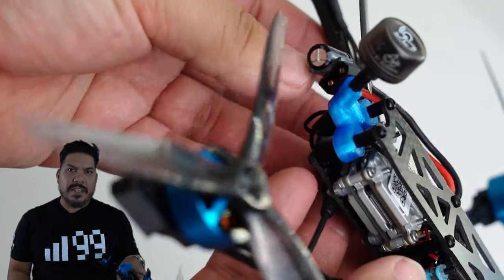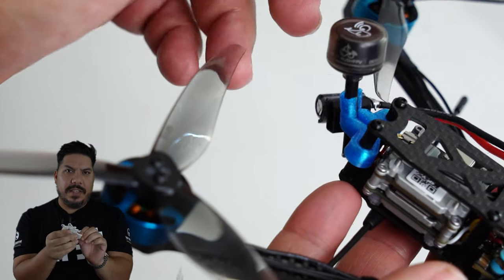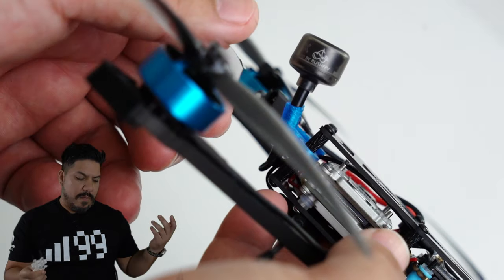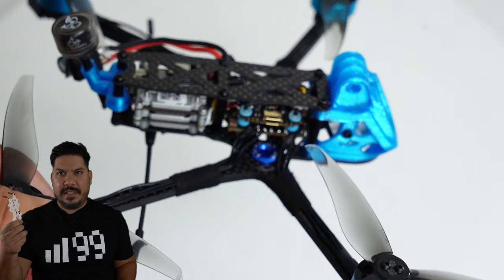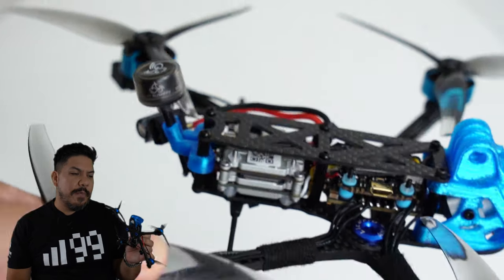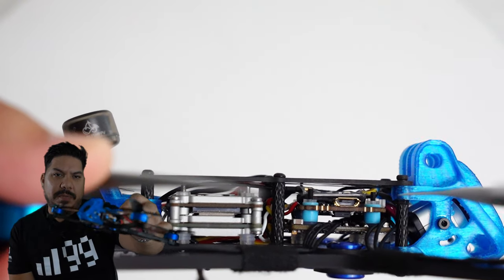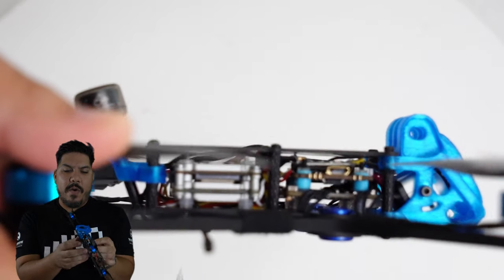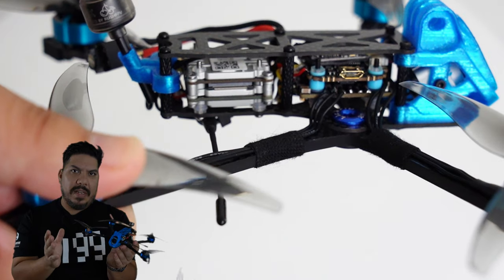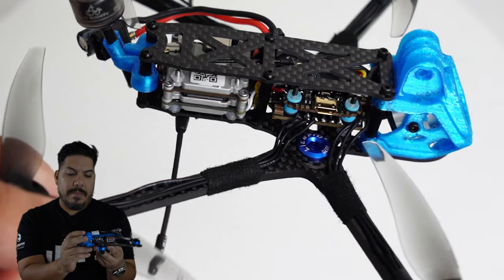When I stumbled upon this, I was actually working on my own frame design. I've kind of modeled it out and printed it in PLA just to get the sizing right. And so this is the bottom plate that I was going for, but this really checks off all the boxes, so I'm not sure if I'll continue with this process or not. I probably will create something there pretty soon just to try it. Is this a freestyle basher? I'm not sure. I do really love the versatility and camera protection of this pod design that he has, and I really like how you can get a lot more versatility from a traditional top and bottom plate freestyle design with the concept of a TPU mount like this.